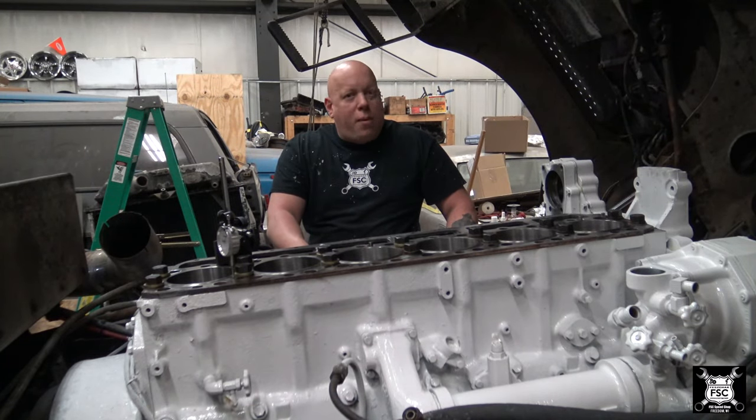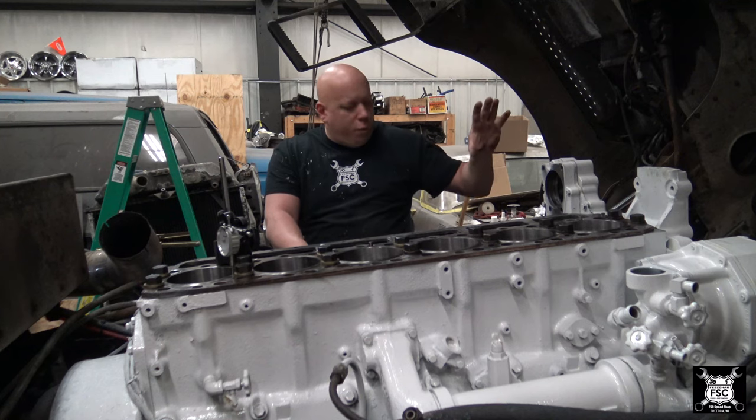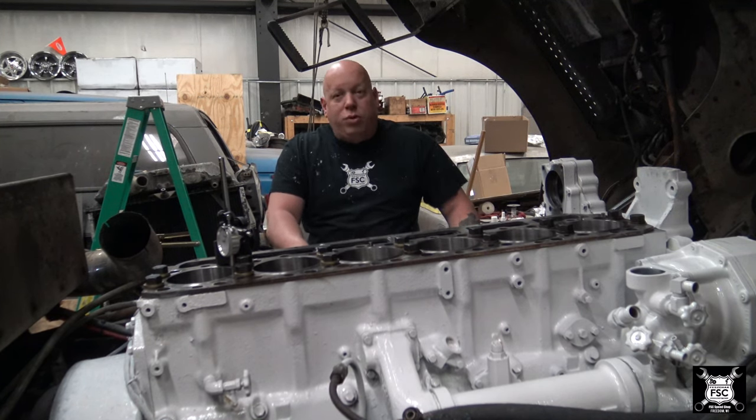Determined to not have this problem again, and despite the fact that I had just sunk a ton of money in this truck to get it running, I then opted to do a complete rebuild on the engine. Not just a basic in-frame, but also took the front cover off and replaced all the gaskets. I'm chasing all them oil leaks too. If I have it apart, I may as well do the full job.